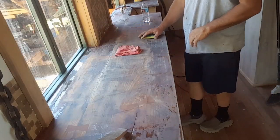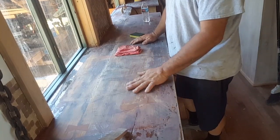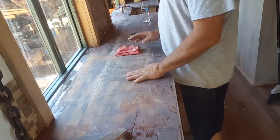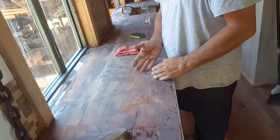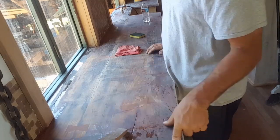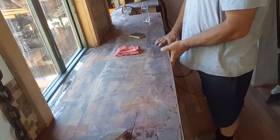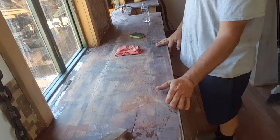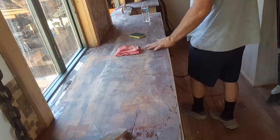Back here in the Park Model 24, we've got a nice even coat of our West System Epoxy. We've taken the majority of it off the top, still left all of our saw marks, filled in all the gaps and the holes around the edges, built up this edge, and cut it down with a belt sander to make a nice rounded even surface. We're getting ready to prep for a tabletop finish.